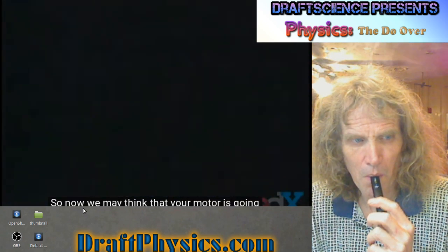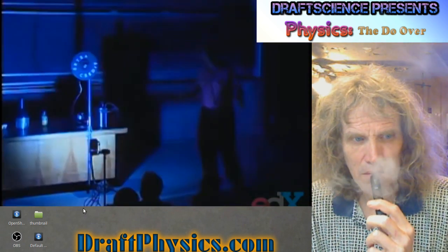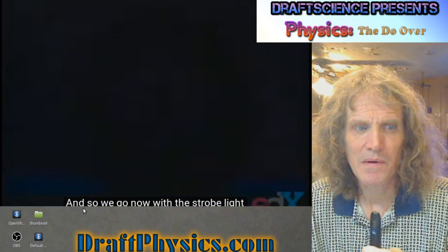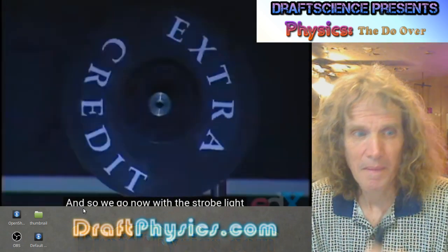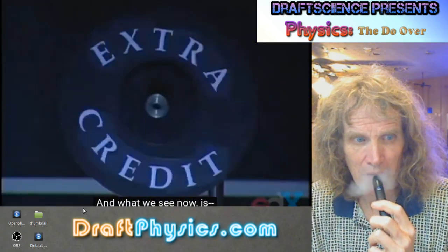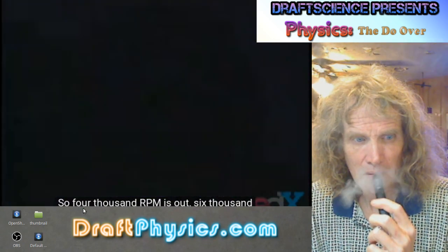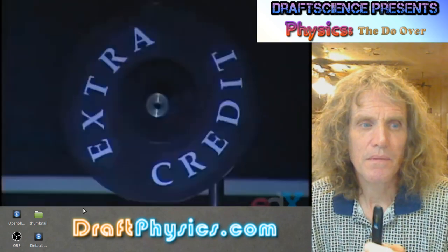So now we may think that your motor is going 1000 RPM, but we don't know yet. Maybe it's going 2000 RPM, maybe 3000 RPM. So what we're going to do now, we're going to double the frequency, and so we go now with the strobe light to 2000 RPM. And what we see now is a double image. So 2000 RPM is out, and any multiple of 2000 RPM is out. So 4000 is out, 6000 and 8000 is out. But what is not yet out is 3000 and 5000 and 7000. So we would have to test for that.